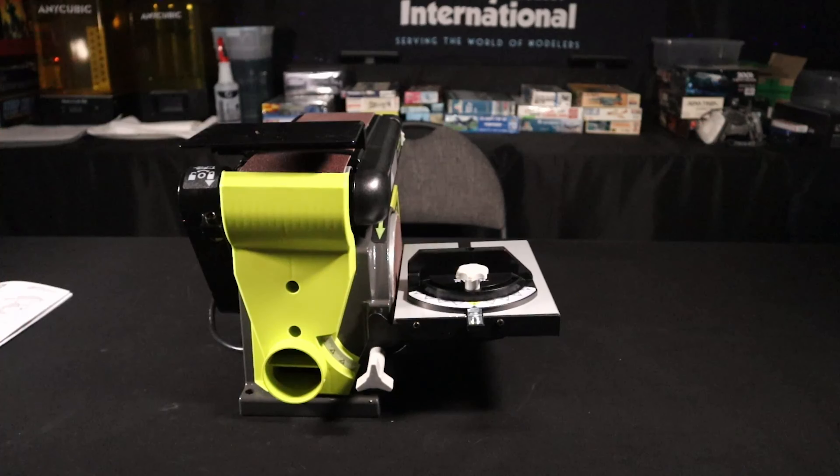We can lift this back up into position, but if you want to sand on a 90 degree angle, you have to get back to this positioning bolt, which is not the easiest thing to do. We're going to have to take off this piece again to get to the locking nut so we can go to 90 degrees — I did not see that in the instructions. Once in this position, pull this lever up to take off the belt. Just push down a little bit and it'll come out. We could push this off and put a whole new belt on — just make sure you can see a little bit of the spindle showing, lock it back into place, and our belt is on.